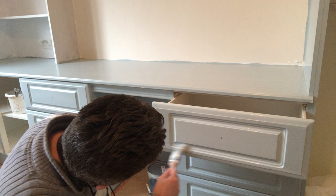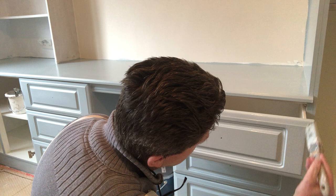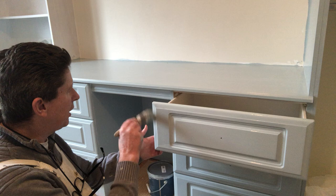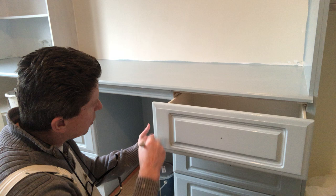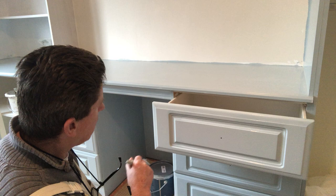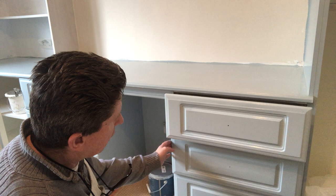So this is the second coat of satin. It's had two coats of primer — the Prime Two. When I was doing this job at the start and doing a video on it, you look at the primer and go, that doesn't really look great. But even when you start putting your finish coat on, it's still important to lay your primer off fairly lightly, the way I'm doing now with my brush — just check for runners and lay off very, very light. Push that drawer in there — don't push it in too tight.